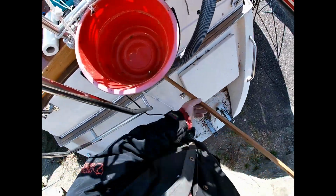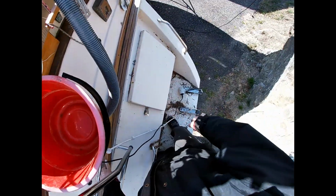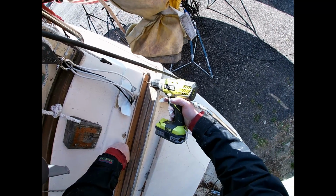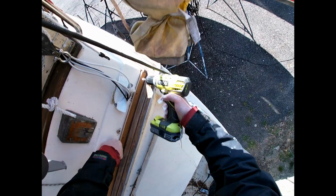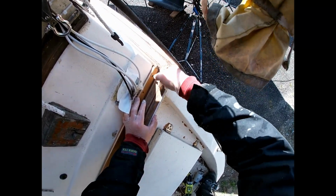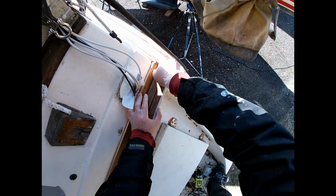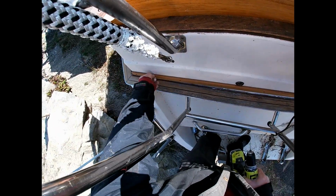You can see I've drilled the holes I talked about. I didn't film everything because that would be too boring for you, I think. Put it in there. And as everything is bent, I need to start in one end, so I start at the right end here in this case. Drill a hole, put some brown sealant in that hole, then a screw to hold it down, and I tighten it quite a lot because I want the friction there. There is some bending force involved later on, so just to make sure nothing moves. The same on the other end.